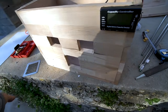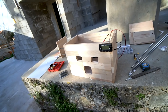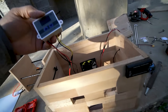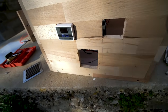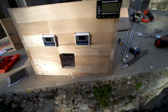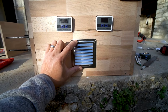When this is all closed up with a top on it, air is only going to come in through the front intake — it won't be completely air-tight but this will be the main air intake, with air coming in through here and exhausting out the back when the fan kicks on. The fan really won't run much except in really hot weather. These two other holes are cut for my temperature controllers — there are two little flanges with holes that screw in from the back so they don't take up interior space. One controls the heater and one controls the fan, and all my controls will be accessible from the outside.